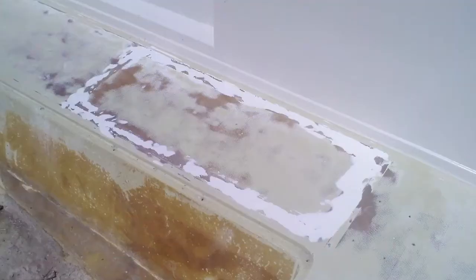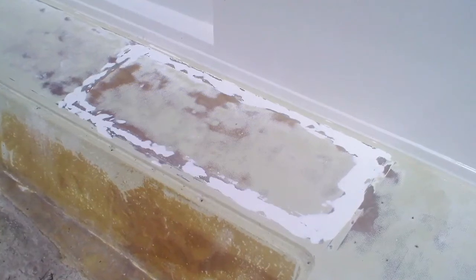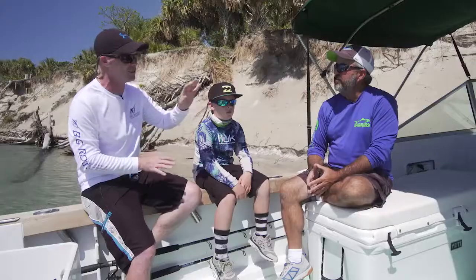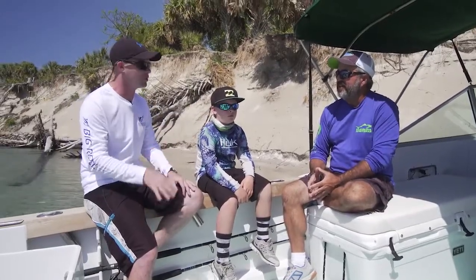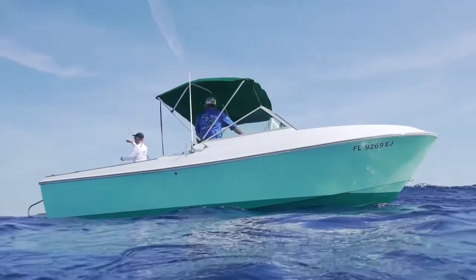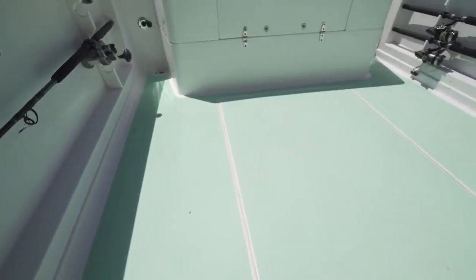The finish work and paint job look really nice — it's a cool color. He used 545 primer then painted the whole boat, using all-grip non-skid beads and texture on the floor. Beyond cosmetics, he added modern-day electronics — GPS, depth finder, and a fuel flow gauge. He also added a battery charger since he runs two house batteries and a starting battery, so it's always nice to keep them fully charged. He completely rewired the boat from scratch — there was not an ounce of copper in it when he started. The original seat slash cooler is still there; he tried hard to find a matching one for the other side but ultimately found a 250-quart cooler that serves as tons of storage — fish storage, ice and drink storage — and makes a really functional seat.